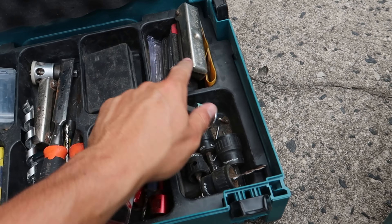I've got a hammer holster and a chisel holster. The chisel is a demo chisel — sharp front and side — and I use it for absolutely everything, with a four-fold to go with it. The hammer I'm using is an Estwing, I think 22 or 24 ounce, pretty lightweight. It's getting old — the bottom's nearly worn out, so I might be looking at a new one. Around the back I've got some nips, though I don't use them as much as I thought, so they might go. I've also got suspenders, which are handy when the nail bag's full.